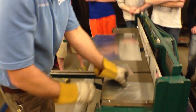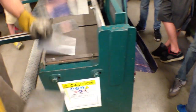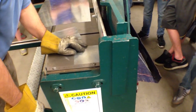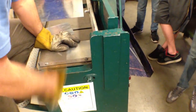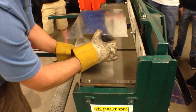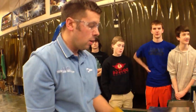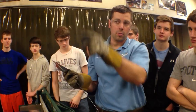You can take that back, go to the 8-inch mark again. I've got two that are 6 by 8, and it looks like I'm going to get one more out of there. Do not reach when it's this close to the blade — there's no need to reach around, that's what the tray is there for. Just keep your hand on the front side and shear it off. I've got three that are 6 by 8 and they should be pretty much the same size. Those are my starters. When you're done with the shear, go around back, grab your scrap material. If it's really small, throw it in the big blue bin — the steel recycling.